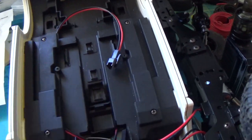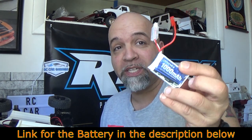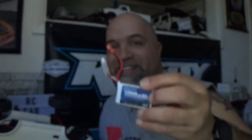The other thing they mentioned was to change out the battery. The battery that comes with the WPL C74 has a discharge rate of 5C, and they said to go at least 10C for the Res V3. So I got a whole new battery — a 2S LiPo with a 35C discharge rating. WPL said the stock battery doesn't have enough discharge rating for the Res V3 circuit board, so they recommended at least 10C. I got a 35C, and yes, this battery does fit in the cubbyhole underneath the C74.